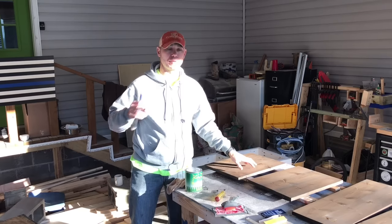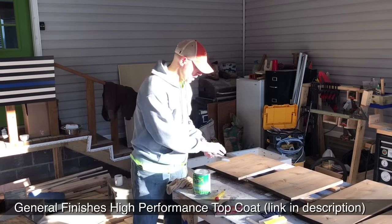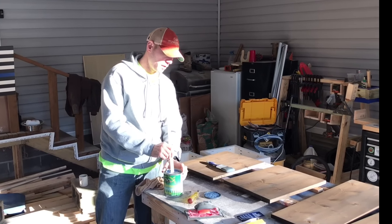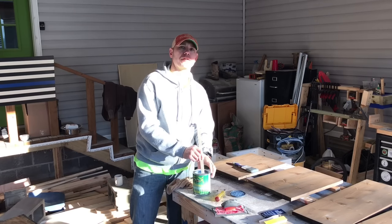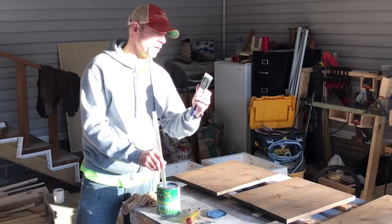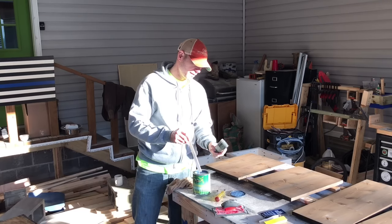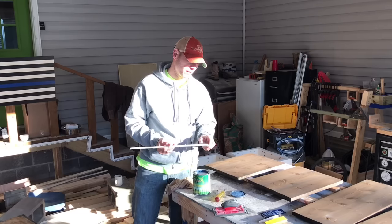I usually put two coats of clear on the bottom shelves and three coats of clear on the top. I use General Finishes — I buy it off Amazon, I'm not sponsored by them; I won a small can of it on Instagram, loved it, and have used it ever since. This is a satin finish. Be sure to stir it because if you don't, all those resins settle to the bottom and it'll come out glossy. Don't shake it — that puts bubbles in and they transfer onto your finish. It's about $30–35 a quart.